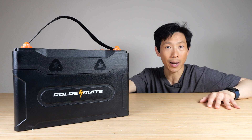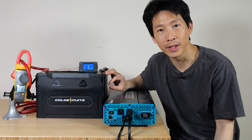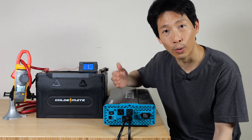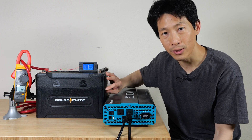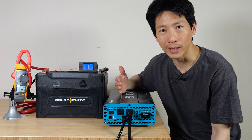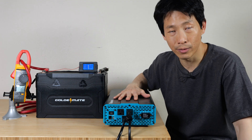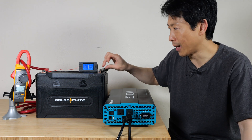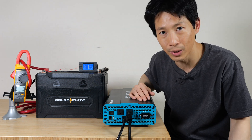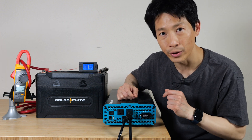So with that said, let's test this battery out. Typically, lithium iron phosphate batteries of this size can do 100 amps continuous. This one says it can do up to 200 amps for less than five seconds. Usually what happens is it can go over, but it's going to overheat some stuff. The temperature sensors inside are going to sense this and then shut everything down. So the five seconds really depends on the ambient temperature as well. I have a 3,000-watt inverter here, so it can pull more than 200 amps out of this. The cables are only 2-gauge, so it's not meant to do a sustained 200 amps. I have connected two loads, which are power stations, and I can vary the load so that I can reach 200 amps.